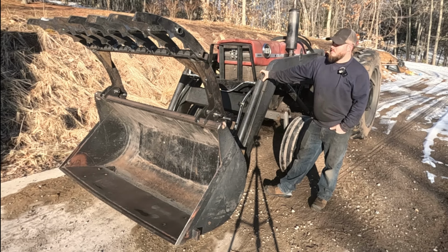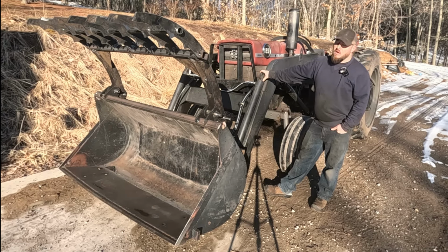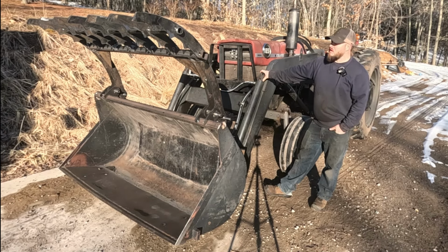So part two will be finish welding, everything, which I won't bore you with because I've got hours of welding. I haven't decided. I might take this over to my neighboring farmer who's got a nice 250 amp Miller MIG welder. And every once in a while, if I've got enough projects to justify it, I can just drive something over to his shop and weld it up there. Or I'll MIG weld here the stuff that isn't real critical on weld penetration, and then I'll stick weld anything that is critical. And that's probably the route I'll go, just because I'm slowly getting better at stick welding, and that only will continue if I continue to stick weld. So it seems logical to do that, but I don't know.